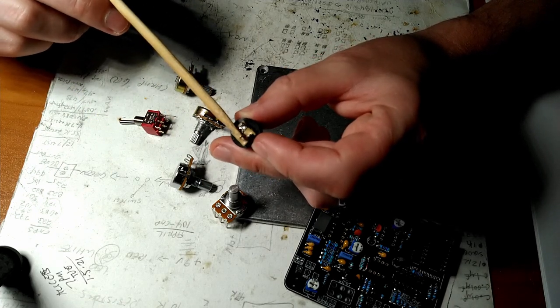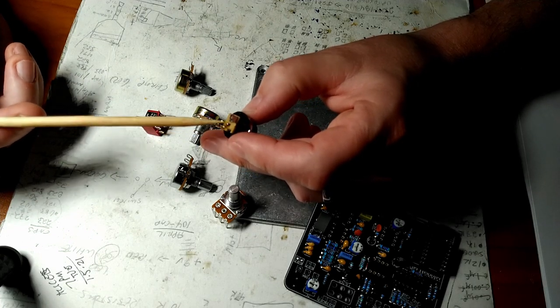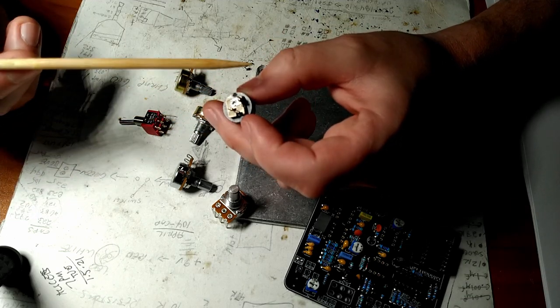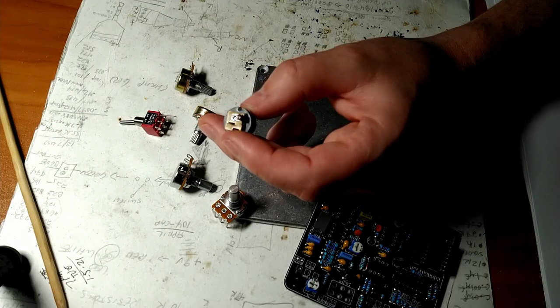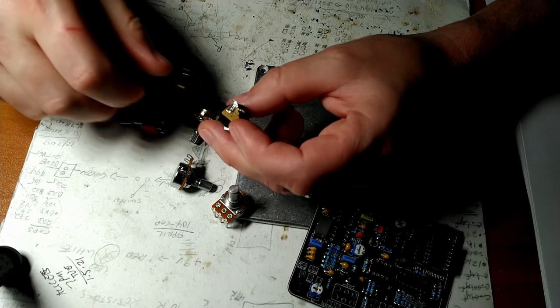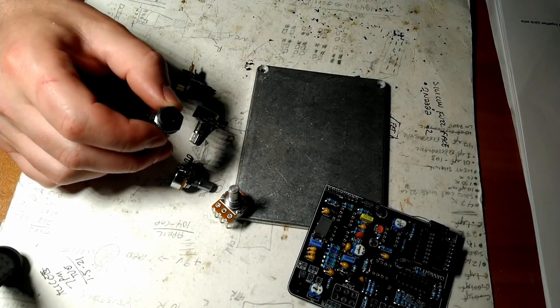If you have your battery connected here and you have your hot for your 9-volt pedal power supply right here, it'll run on battery until it's plugged in, and then it'll shut the battery. That'll shut this lead off, but we don't use batteries, so we can go ahead and see you later. And there you have it. I have another style of this guy. Let me see if I can find him real quick.